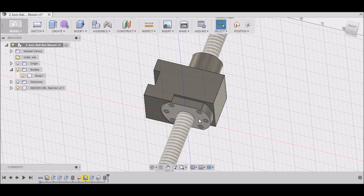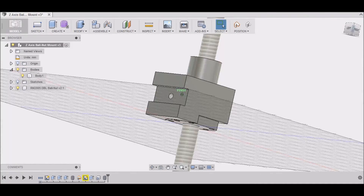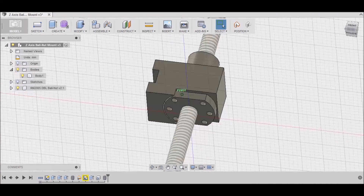I did this because I only ended up with about a quarter inch sticking out the bottom when I was all the way down. I measured it and came up with 600 millimeters, but you really need to have at least an inch or two to be safe. Give yourself 650 millimeters — you can even go 700 millimeters. There's plenty of room at the bottom; it's not going to hurt anything. There's probably another eight inches before you hit the actual top of the base, so leave yourself plenty of room. You can see how the Z-axis goes through there with the ball nut, and that's how it's going to mount up.